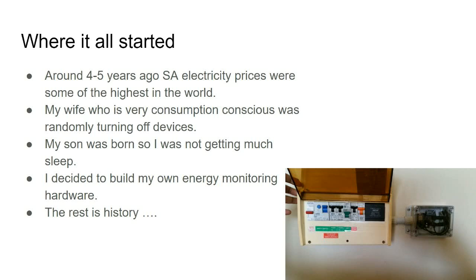This was one of the initial versions I built. It uses a NodeMCU ESP8266 and an ADS1115, which is an ADC, because in order to measure energy, you need to measure voltage and current. The ESP8266 has one ADC, so you need some sort of hackiness to get it to 2. You could use a multiplexer, or you could add another analog to digital converter on top of it to sample both of those analog values. I decided to use a really bad choice, as it turned out in retrospect, a slow analog to digital converter.